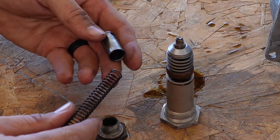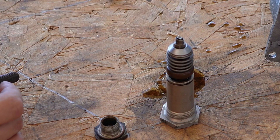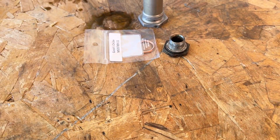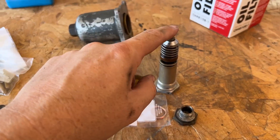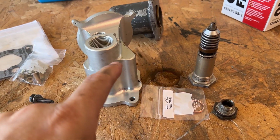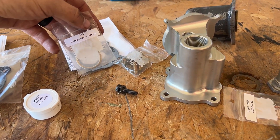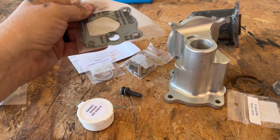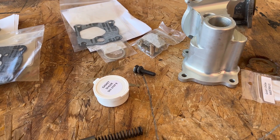That's the difference — oil viscosity versus oil temperature — much better. This comes with a new gasket and I just put it back on as a plug. Next, let's get the adapter installed. It comes with all the hardware I need, the gasket, and a new Vernatherm gasket. It also comes with gasket sealer that helps seal it a bit better — I have some over there too, but we'll use what they provided.